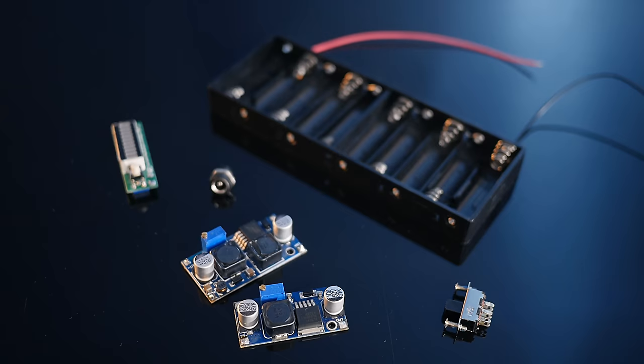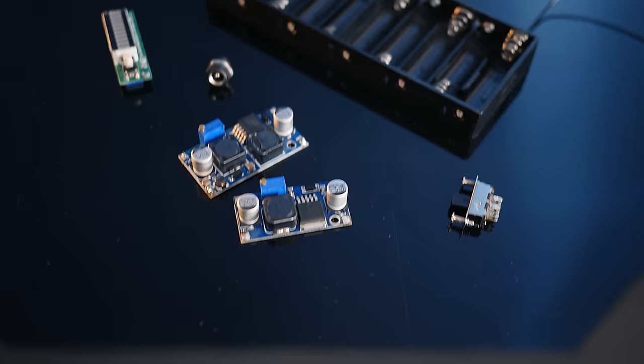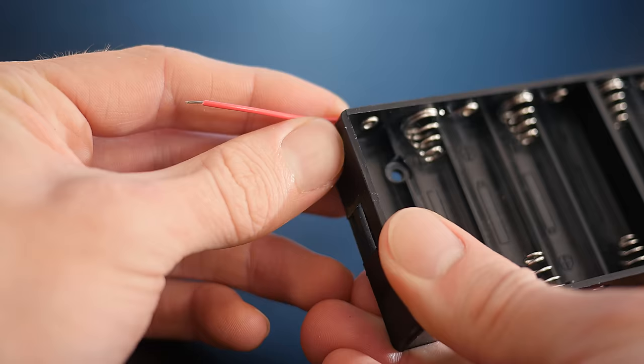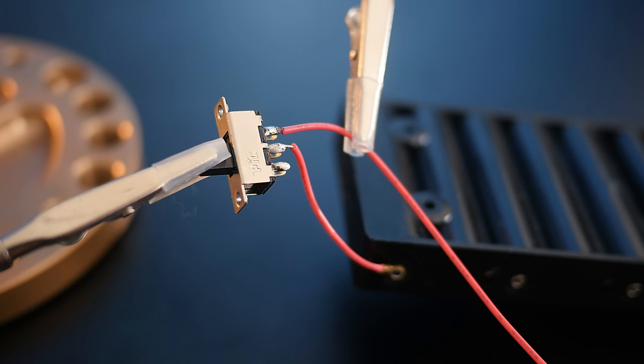I'll be introducing these individually as we build it, and keep in mind that you can find purchasing links for every component in the description. The first thing we'll need is a plastic battery box that will later be populated with 10 rechargeable AA batteries. Its positive output lead can then be soldered to the middle pin of a large slide switch, which can then have a spare wire soldered onto either adjacent pin.